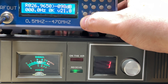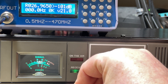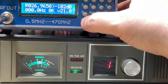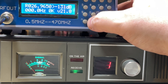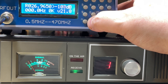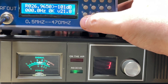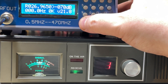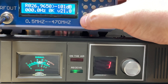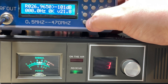Now we drop the dB and as soon as we get to 101 the signal just drops off. Right on 101, and then all the way down to 132 it's pretty unresponsive — you can hear it, but the main issue is around 101. This shouldn't do this. I can only think I've transmitted into it by accident and blown something in there. It's quite a definite signal drop around the 101 area.